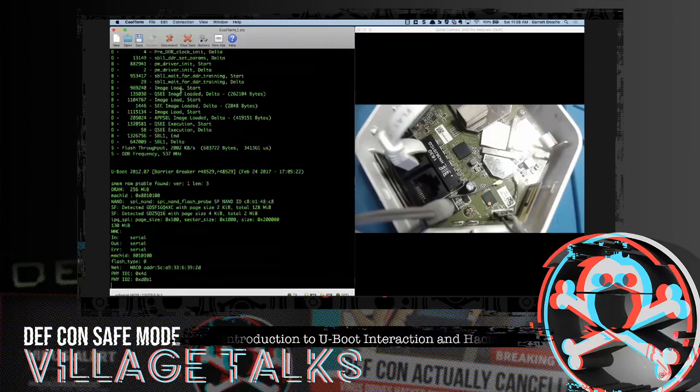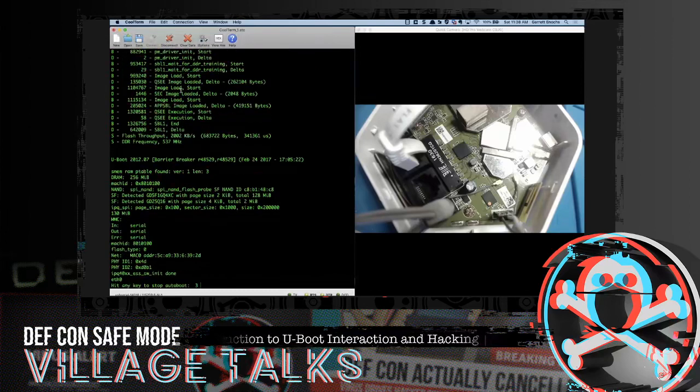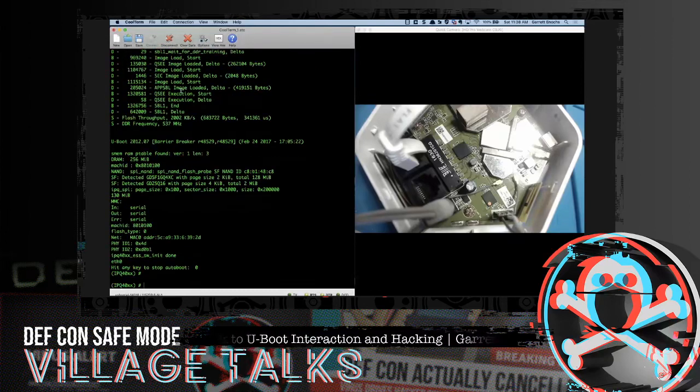So like I said before, you know how the cooking shows do it. They don't cook that whole turkey right in front of you. That'd be crazy. But they have one already in the oven. So that's kind of what happened here: I pin glitched this thing prior to this call so that I did set this boot delay so that I could break out of it and get in there and actually show you some stuff. So similar to before, print environment variables.